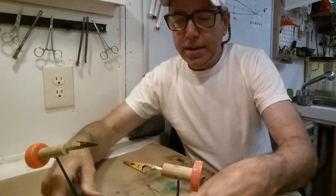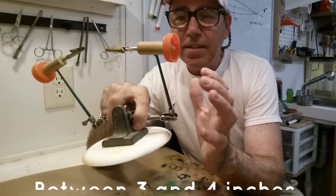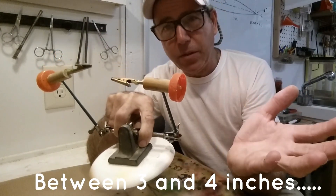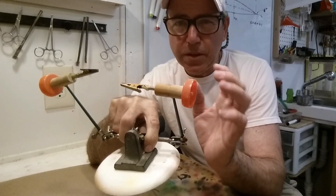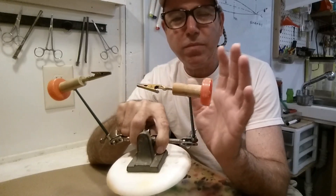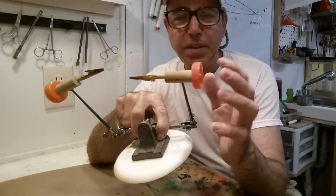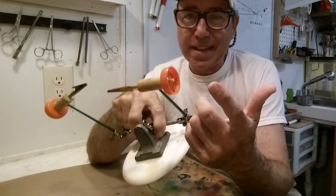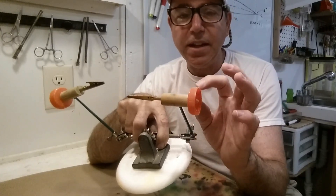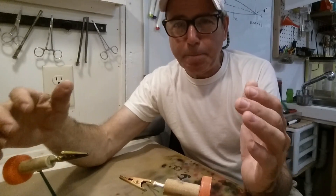If you go to build this, two things to keep in mind. One: don't make the legs too long — these are about as long as you ever want to make them. The longer you make them, the bigger the lure, but also the more difficult it is to align the two spindle heads. Also, keep the weight down on top. Don't put anything really heavy up there. A light knob is actually a pretty elegant solution — easy to put on, nice little grip, lightweight, and an easy build.